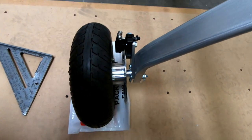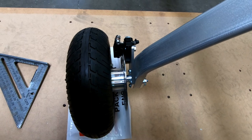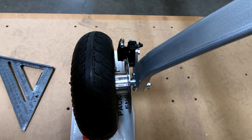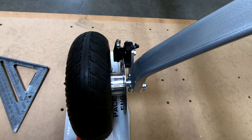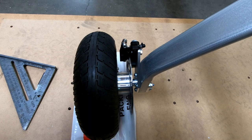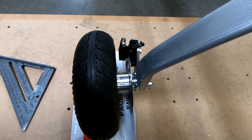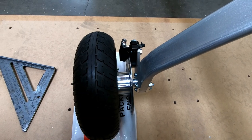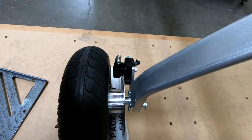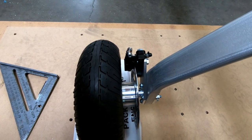And when you think about it, we're going to be setting up that brake caliper in the correct position with the empty weight on the airplane, but that's going to include the airplane itself. So if the empty weight of the airplane is 175 pounds like it should be, we'll center that caliper right on that brake rotor at that weight, and then the only flexing it's going to do is between 175 and whatever gross weight ends up being, whether it's 380 or 400. So you're going to get less flex than what we're actually seeing here because we're going from basically no weight on it at all to full weight on it.